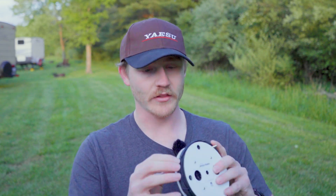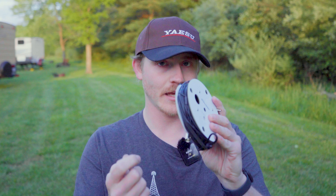Final thoughts: all in all, I think this is a really awesome design and I really like this antenna. It worked really well during the park activation and we made quite a few contacts. I was actually shocked at how it performed versus other end-fed half-waves I've used at the park. It's really well built — just a couple of things that could be improved: these grooves on the spool could be just a little bit wider to make it easier to wind back up. Deployment is fast with no problem, but when reeling back in you miss the track a little. Just a couple of extra millimeters would be all you need. Other than that, this antenna is just really well made — all aluminum, great build quality. Great job to KO4HUI on the design. I'm probably going to be buying one of my own pretty soon.